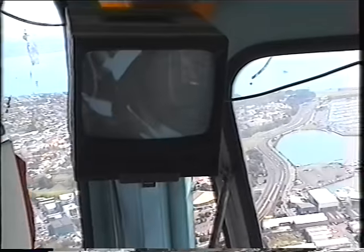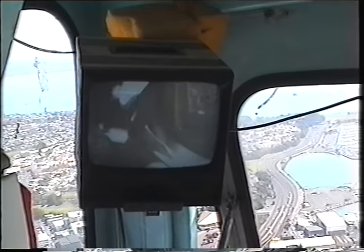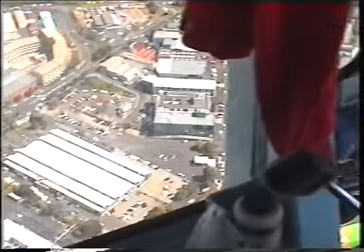Now this is an interesting little machinery. Right on the left there is the screen. If you look at the end of the jib there, actually we're so close up now, there it is, that little green box, that's actually a camera, and it helps the boys to focus from the screen to see what's on the ground. Once the trolley runs out to the end, the camera focuses right down on the vertical drop, records what's on the screen, and tells us where our load or our block is. Very good, isn't it?